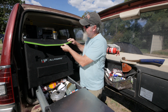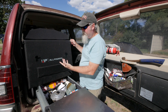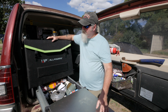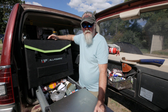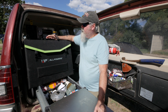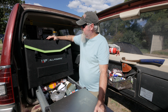Construction and size — all massive pros. The stitching feels good. In both the one I purchased myself and the one AllPowers sent me, I didn't see any loose threads or stitching. All the little loops for hanging or pegging down seem very good — everything about it just seems nice. It feels like a more expensive product than it is. And that brings me to the last big pro: price. You have to shop around a bit, but I've seen these down to nearly a dollar a watt in Australian dollars during sales. At that price it performs really well — in fully overcast conditions I get a couple of amps, and in full sun I'm getting about 12 amps. When the weather gets really hot it can drop to about 9 amps, but besides that it's all good.